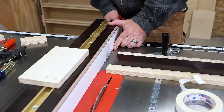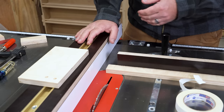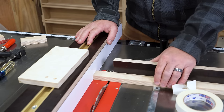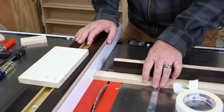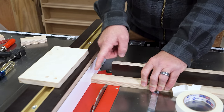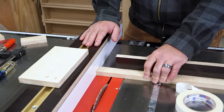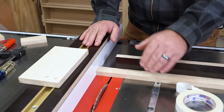If I want to make a whole bunch of pieces that are two inches, I can set my fence to two inches, but I have a problem. You never want to use the miter fence with the rip fence at the same time — this is going to cause a pinch point. It's going to bind and kick back at you. It's not a matter of if, it's a matter of when. So how do we get around that?